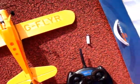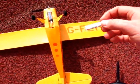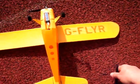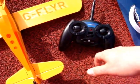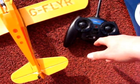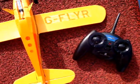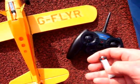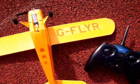Alright, I'm back. I'm just going to give a little bit of tips on changing batteries. Here's my 160 milliamp. I'm going to replace it. If you're already bound to it and you're changing batteries, do not turn the transmitter off. For safety reasons, if you want to turn it off just in case something happens after you put the new battery in, by all means do it. But this will help you from having to rebind your controller to your plane.